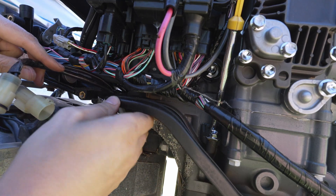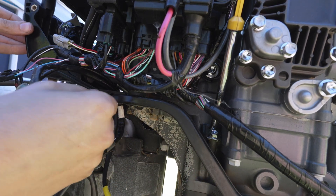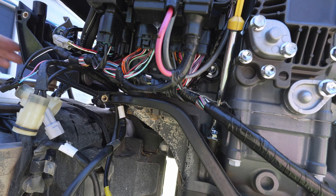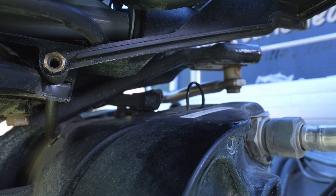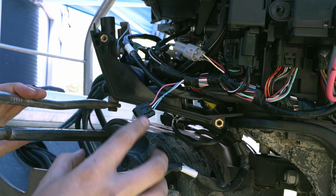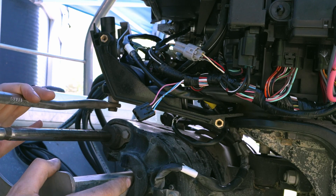Make sure I've got enough wire out there that I can adjust it should I need to. Put that back on — we will need to put a zip tie through here but we can reach that with this on there. Now that we've got it wired and hooked up, we're going to have to put our cowls back on and then go through the process of resetting the tilt and trim limit which is stored in the ECU. We'll get to that in just a second — let me put all these cowls back on and then we'll catch back up.